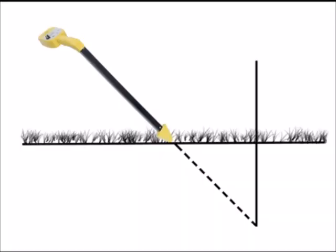This graphic will illustrate how we use the triangulation method to find depth of a cable. The horizontal distance, or horizontal leg, on a right angle triangle, or a 90 degree triangle, is equal to the vertical leg. So if we can figure out the distance of the horizontal leg, it will tell us how deep this cable is.